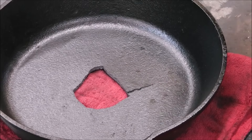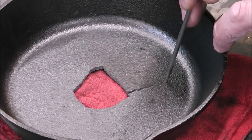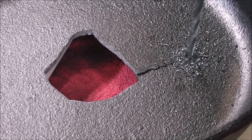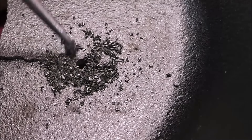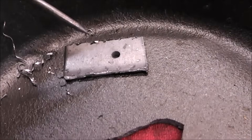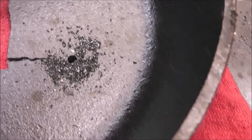The fourth way to determine if your part is cast iron or steel is to drill it. Drilling cast iron looks completely different than drilling cast steel. As you can see, we have a long crack that extends the length of this — we have to stop-drill this to prevent the crack from continuing on. If you just weld this up, the crack will continue to migrate outwards. Take a look at that — it's more of a filing than a chip. Very short, almost looks graphite-y. Very different than a steel chip. Here's our mild steel and this is the material removed from it — you can see the bright and shiny curly cues. They look nothing like the powdered dust that came out of that hole.